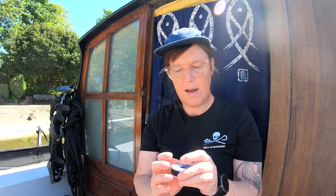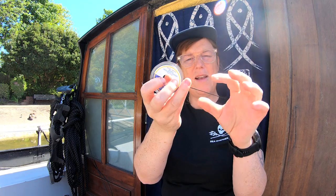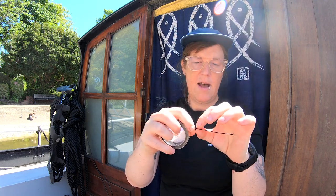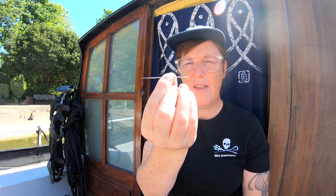So yeah, I sat with a neighbour the other day and we did that. We used this waxed whipping twine, and as the name suggests, it's a plastic, like a polyester line, and it is slightly waxed so it sticks together. It's slightly hard, and also these sailmaker's needles have a triangular end, and then they have a shorter back, and obviously they have a really big eye for big twine, so that allows me to stitch through.